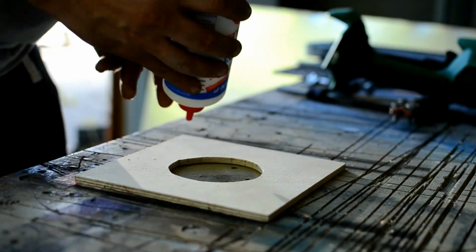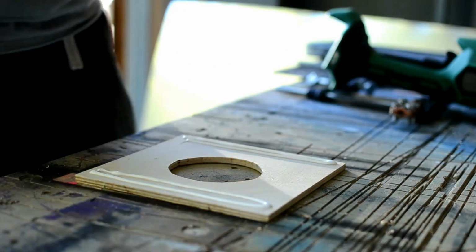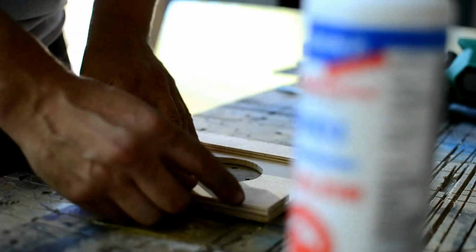So now we've got that air going where we want it to go, we also need to be able to control how much of it's going in. You blast too much air in, you're just going to burn the fire out and melt everything you put into it. If not enough air going in, you're never actually going to get up to a good temperature. So to do that, I'm just making a really basic air gate. It's just 2 bits of plywood with holes in and another piece that slides in between, restricting the amount of air that can actually pass through it.